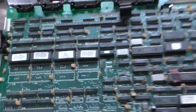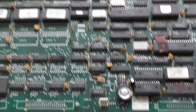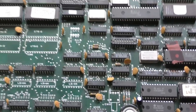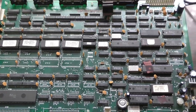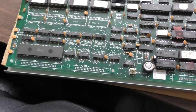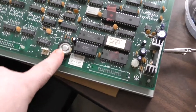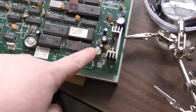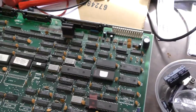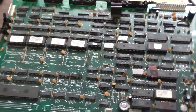I said the machine had no sound. This was the original board that came with the machine when I got it. It came with no manual and no schematics, so I don't know why it had no sound. I replaced the battery, this is the volume — you can turn that up and down — and I replaced the capacitors. Still no sound.